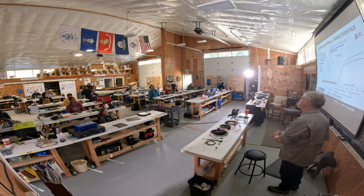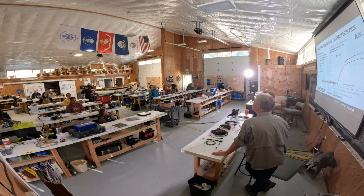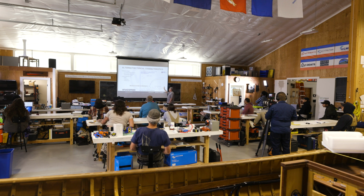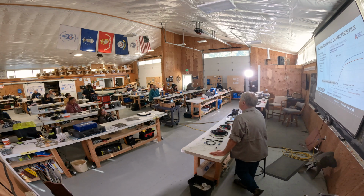Yes, sir? On that specific topic, not that I've encountered a request for a 48 volt alternator, but is the primary strategy for that belt and pulley ratios? Yes, I'm really glad you brought that up. So the answer to this is you do your belt and pulley ratio, and you want to have the alternator spinning. If this thing's rated 8500, I'm not sure I'd try to have it spinning all the way up there. But you want to have it spinning where it's moving fast. That's where the alternator is going to be its most efficient. It's going to have its best cooling. You're going to get the most power out of the alternator. Basically analogous to the power curve of the internal combustion engine. It is. Optimize the speed of the alternator in this case.